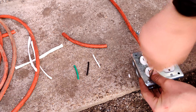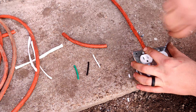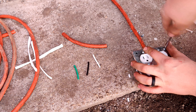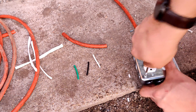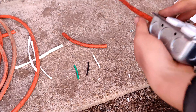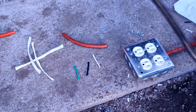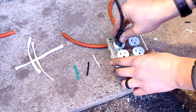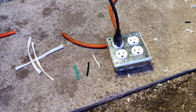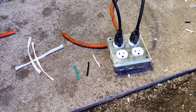I would not suggest building this box if you have anything less than 12 gauge — they're just going to ask too much of that cable. She's done. That is a built plug. Let's go ahead and plug it in and then plug something into it — we'll test it. Got it plugged in. Going to be plugging in 1,000 watts — there's 1,000 watts running there. We can plug in another — I think this is another 500 watts. You can hear that generator in the background taking the load. But hey, it works frigging awesome.